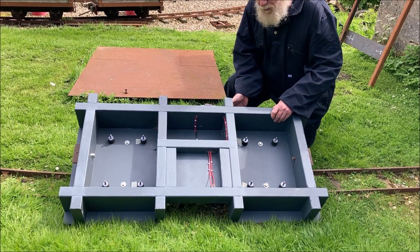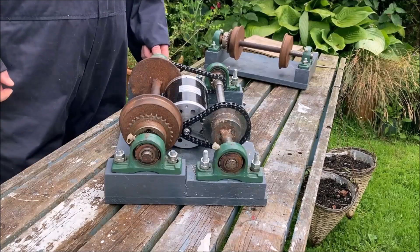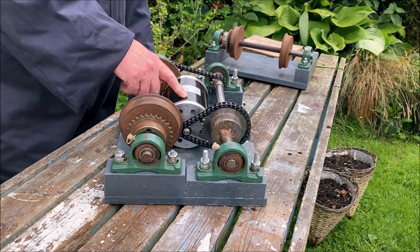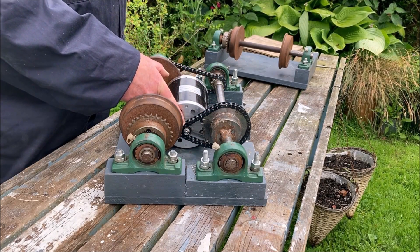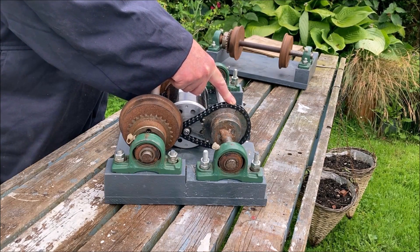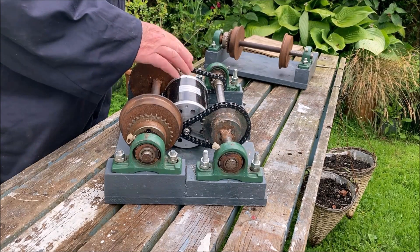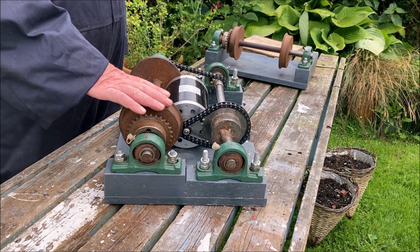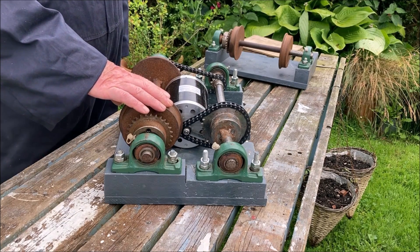There's a little bit of electric wiring in place, but I'll cover that at a later stage. Here's the motor unit, with the motor itself driving a lay shaft. The small sprocket drives a larger sprocket to reduce the speed — the motor turns very fast, but we don't want the wheels going too fast. We're aiming at something more like four miles an hour rather than a hundred.